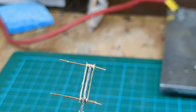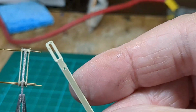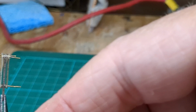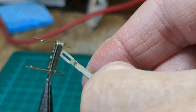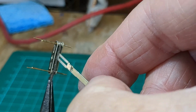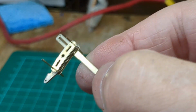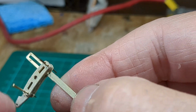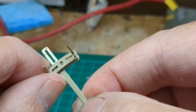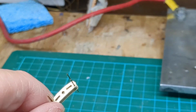And the radius rod, which is this and another piece, there's a wire goes through there, that slips through the centre. There's a piece holds it the other side. Hang on, sorry, I'm trying to look. And so basically, it allows, when it's done properly, and there's a pin in it, this can slide up and down and put it in reverse or forward gear. So I've got to build the radius rod now.